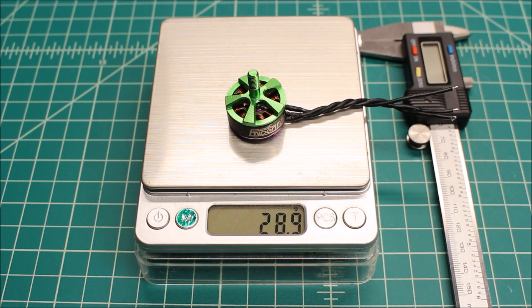This is just to give you a baseline of one motor compared to the next — not so much that this motor is going to pull 36 amps at 16 volts. It's to look at: okay, this motor pulled 36 amps at 16 volts, and on the same test using the same baseline configuration, this one pulled 31 amps at 16 volts. So you can kind of compare. Just wanted to get that out there so people understand how these tests work.